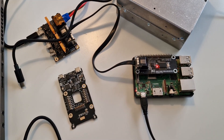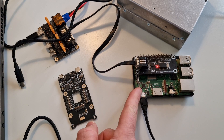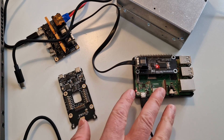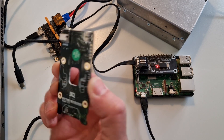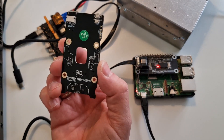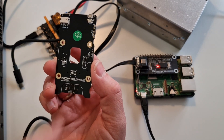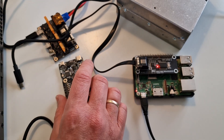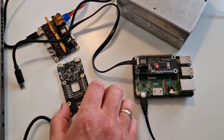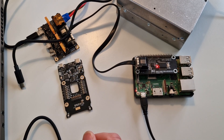Other things you need: a Raspberry Pi already running Klipper. I'm assuming you already know how to do Klipper and that you have it installed and working with your main board, because that is needed. This board is basically only for the hot end — it does have a TMC 2209 chip in there for running one motor, but that's all it's going to run.